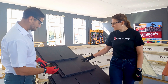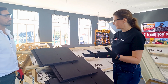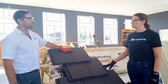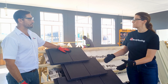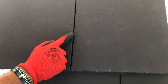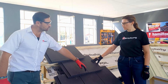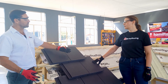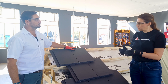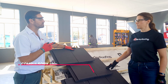I've noticed you've packed the tiles so that the lines don't line up — so why did you do it in this specific pattern? It's very important for a modern roof tile — it must be laid broken bond, which some people call a brick bond. The reason for that is for the water channel to be equally spread over the roof when water flows. If you pack it straight bond, your water will flow directly into the water channel and that might cause leakages. It's actually compulsory to have it packed broken bond.